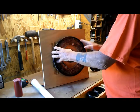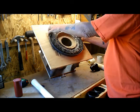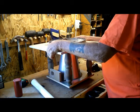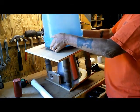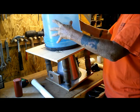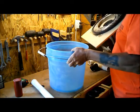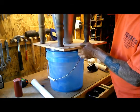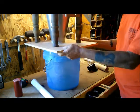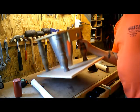On the bottom I used a bucket lid - it's all it is, a regular old bucket lid. I made a wooden ring so I can screw and mount it, again with the clear adhesive, so it's a nice tight fit. The bucket fits right on top of it. If I push it down it will latch, but it's a real pain to get off. You really don't need that - a bungee cord gives a nice fit. You can use bigger buckets; the idea is you need a place for the sawdust to fall and then a way to retrieve it. Dust comes in, spins around, heavier particles fall into the bucket, and the bucket is removed for cleaning.